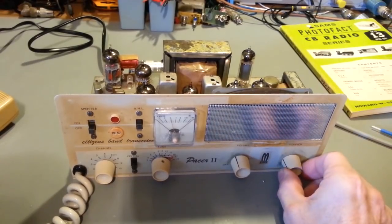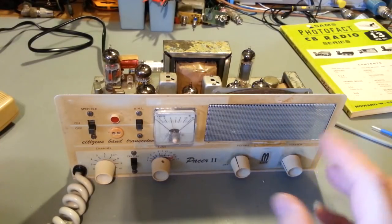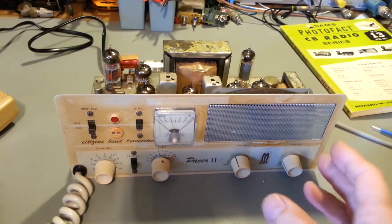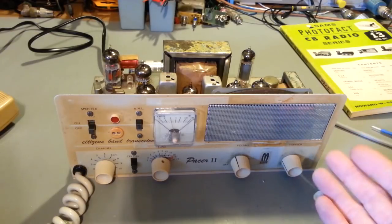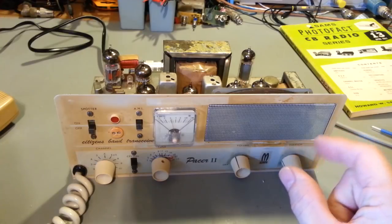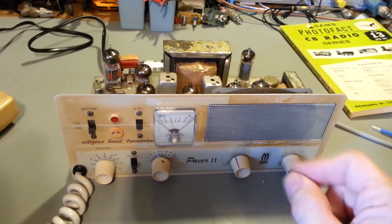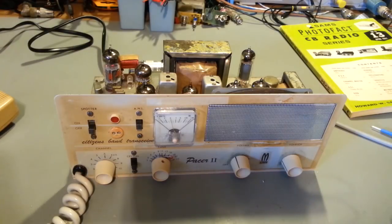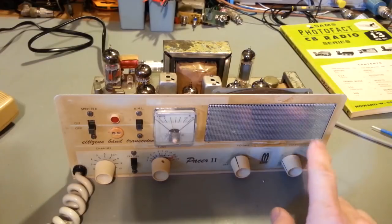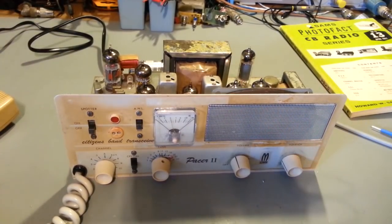But, yeah, like I said, I like the tube type, because I can set it right at that break point. Because the system works different and it's a vacuum tube instead of a solid-state device like a transistor, it kind of comes in and goes and comes in and goes. So it's not just on and off, on and off. It's either full blast volume or just no volume or no audio at all. I really like that in tube radios. I wish solid-state radios worked like that.